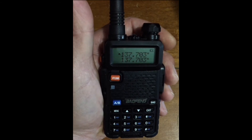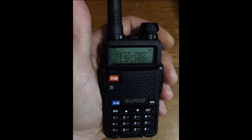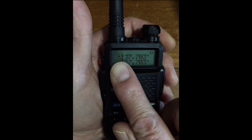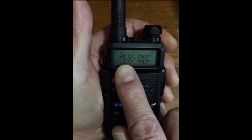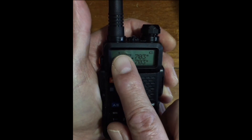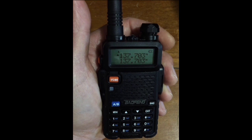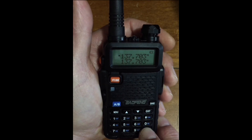The power setting is important. Normally our radio should be set to low transmission power. There is no need to overpower other local radio operators. However, if we need to reach a distant receiver, or if other conditions are interfering with our transmit signal, try setting our radio to high using the hashtag button. High power mode shows no L indicated. Toggle the hashtag button. L indicates low power mode. In summary, use menu item 02 to set our normal transmit power level to low. When necessary, use the keypad hashtag button to toggle to high. Remember to toggle back to low as soon as you can.